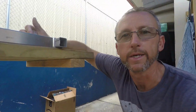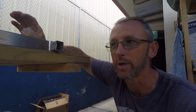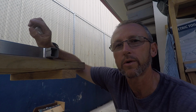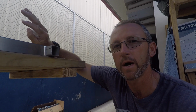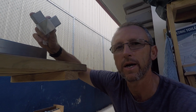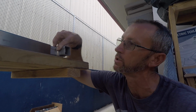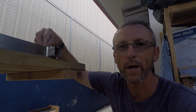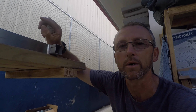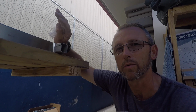So what we're using here is a commercial off-the-shelf hand railing product. It's 316 stainless, which is going to be great for corrosion resistance. If you stick around to the end of the video, we'll give you the name and the website of the company, but they offer all different types of elbows, tees, feet, bases, all different types of attach points that you would see in commercial handrail installations. And these are basically going to be wet installed, pop riveted in places where you're not going to see it. So from a structural standpoint, it's not going to fall apart. And it's going to give us a really nice assembly without any welding at all.